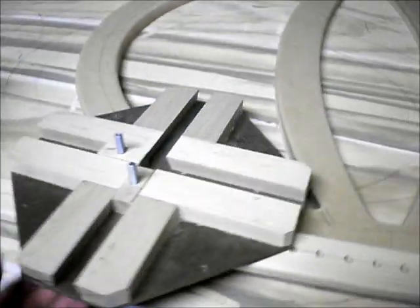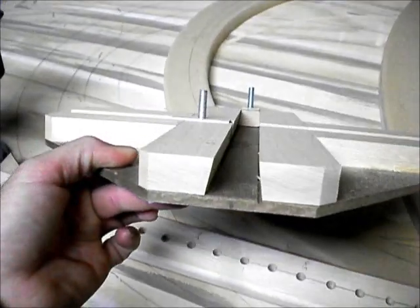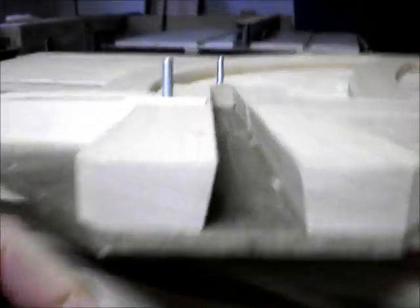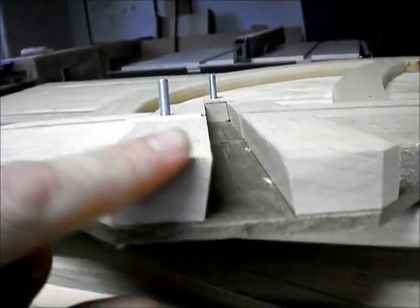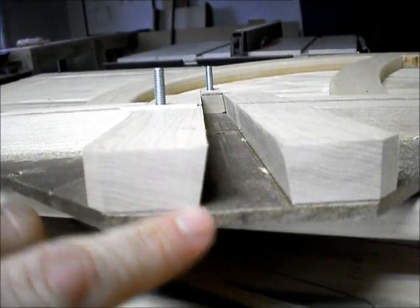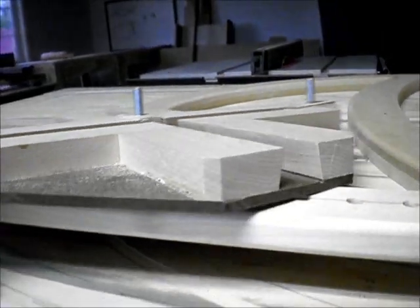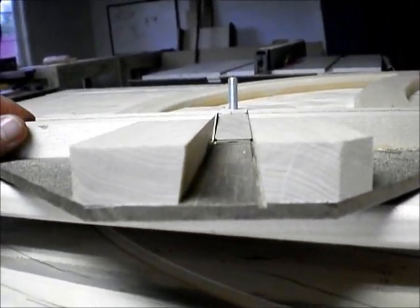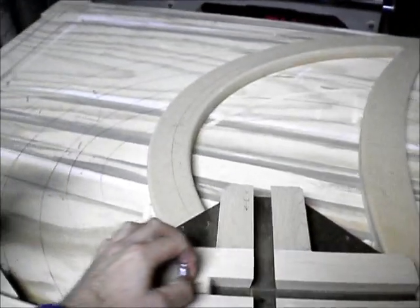What this is, it's just a quarter piece of masonite with some maple glued to it and pinned on it with some pin nails. I just took the table saw and ripped a 10-degree bevel on each side, so now what you have is a grid for your major and minor axes for your ellipse.